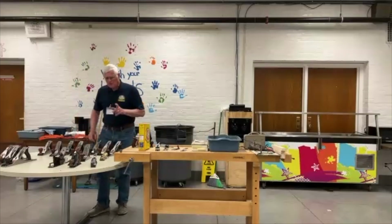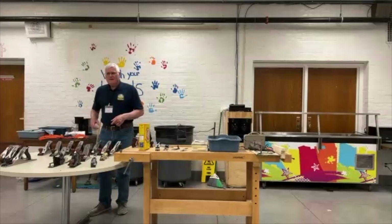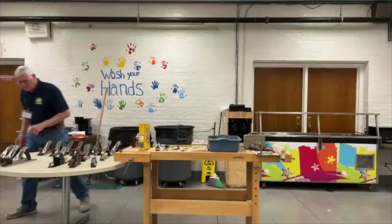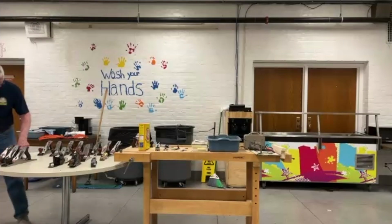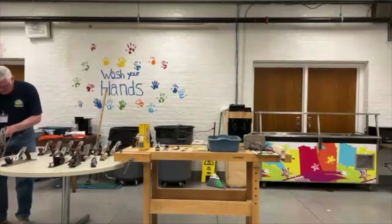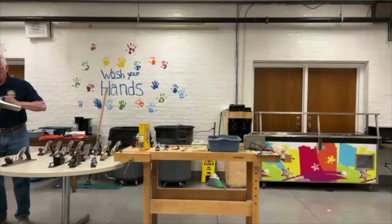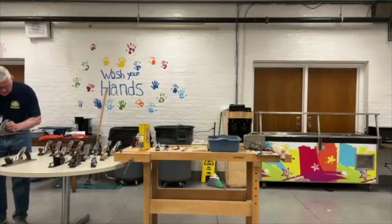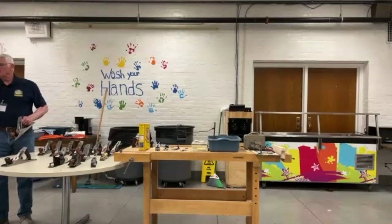And the other thing is numbers. Whether it's a hand plane, whether it's a jack plane, whether it's a bench plane, it all depends on who made it. Unfortunately, there's no set standard. Generally there is, but specifically there's not. So here's an example. This is a Miller Falls. This is a Stanley. They're just so identical, okay? And this one is a Bailey, and I want to talk a little bit about it. Now, this is a number 5, I believe. Yeah, number 5. Okay. This is a Miller Falls number 6.